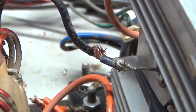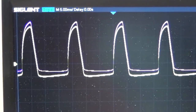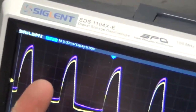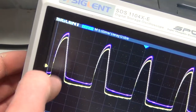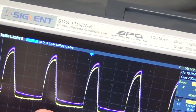I've just twisted the cables together — it's enough to get a reading on the scope. To my surprise, both diodes are conducting at the same time even though they are 180 degrees out of phase, which means one of them should be conducting 180 degrees out. Apparently not — I'm not sure why it's set up like this but it's clearly for current reasons only. There's your voltage — the diode is reverse biased, so not conducting, then conduction, reverse bias, conduction, reverse bias, and so on forever.